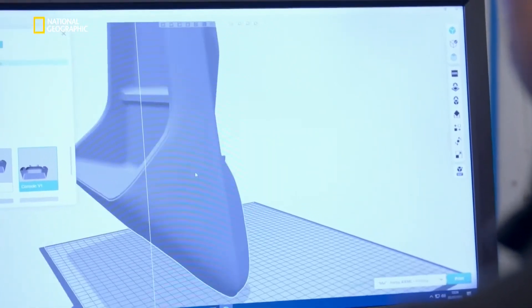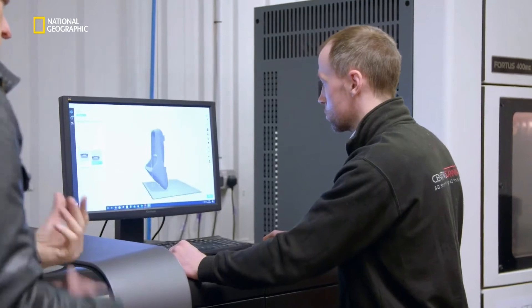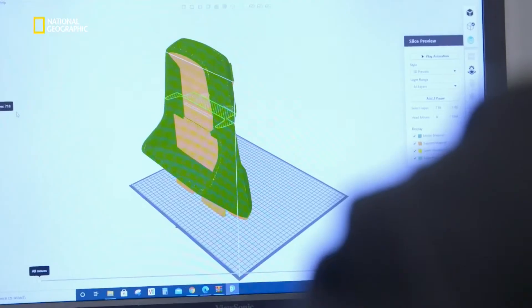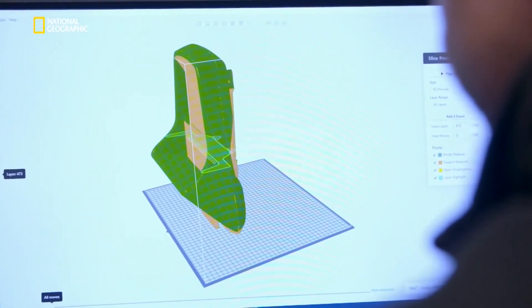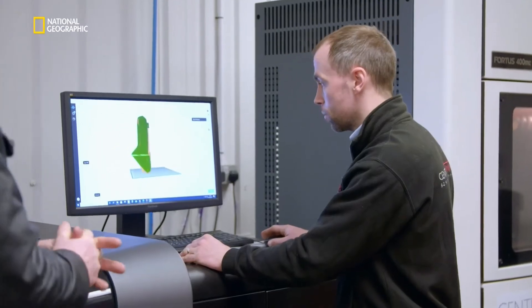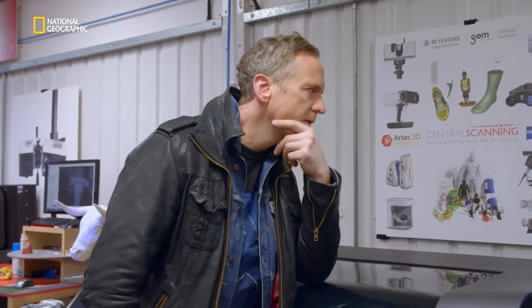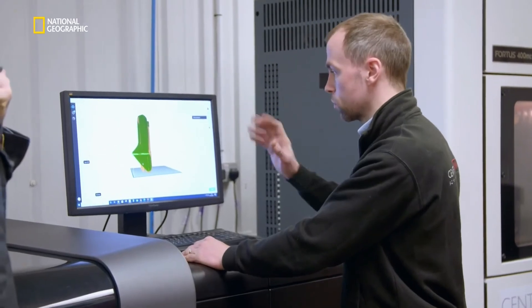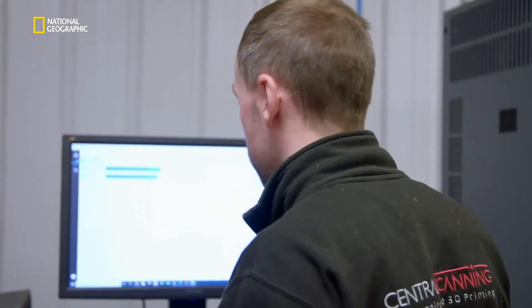My word, that is just so weird — it looks so clean as well. You can start that thing printing straight away? Pretty much, yeah. I'll just check that the build layers look right. The peach areas indicate where we're going to support it, so we don't want it to fall over and we don't want any material delaminating. So we're making sure that any overhangs are supported, and then we can get rid of that support material afterwards. It's not just me that's massively impressed by this — surely this is mind-blowing?